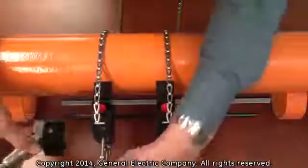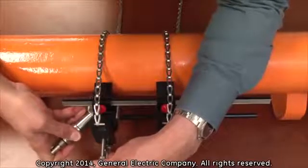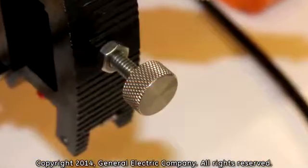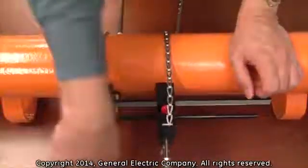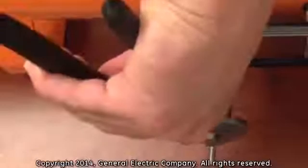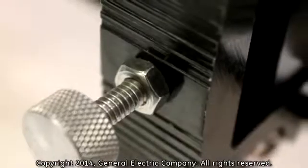For the installation, slide the transducer into the mounting fixture and ensure that the center bolt fits into the insert hole on the top of the transducer securing bracket. Make sure to orient each transducer toward each other so that the BNC connections on the other end of the transducers are facing outward. Tighten the transducer securing bolt on the fixture by hand, then tighten the bolt further by only a quarter turn of a wrench. Tighten the locking nuts on the center bolts until they are firmly tightened to the top of the mounting fixture.